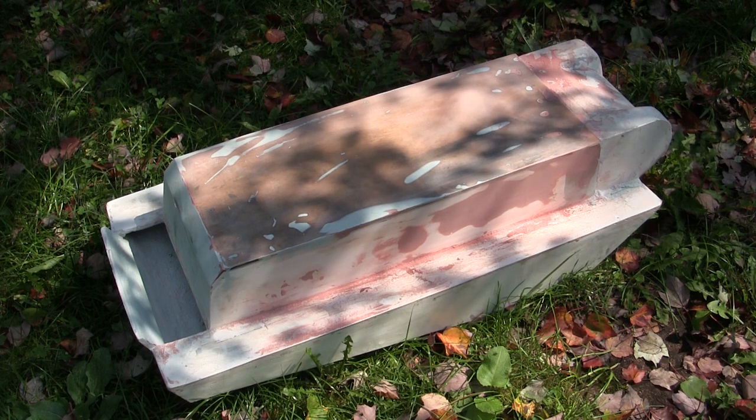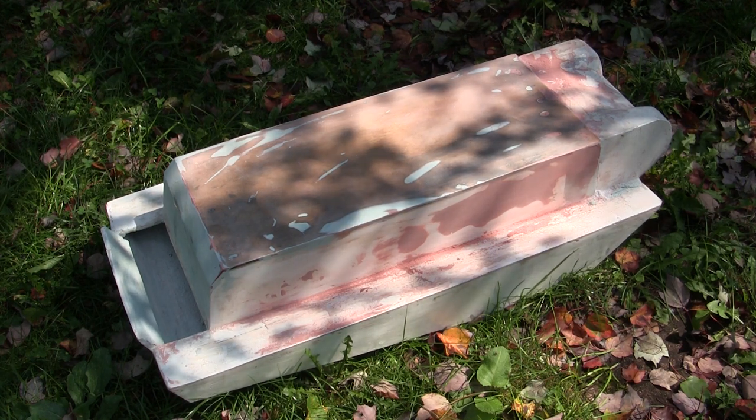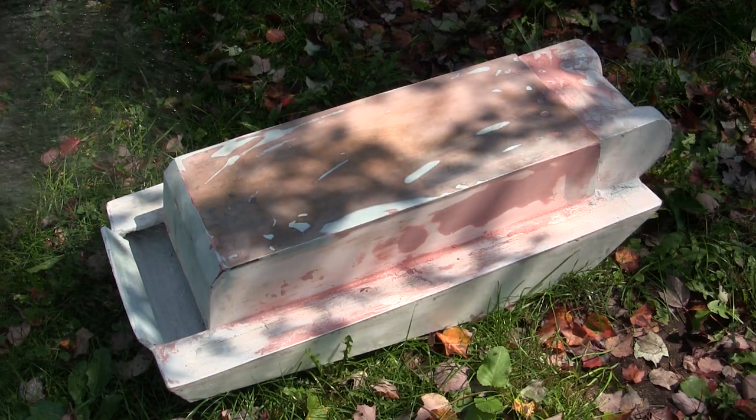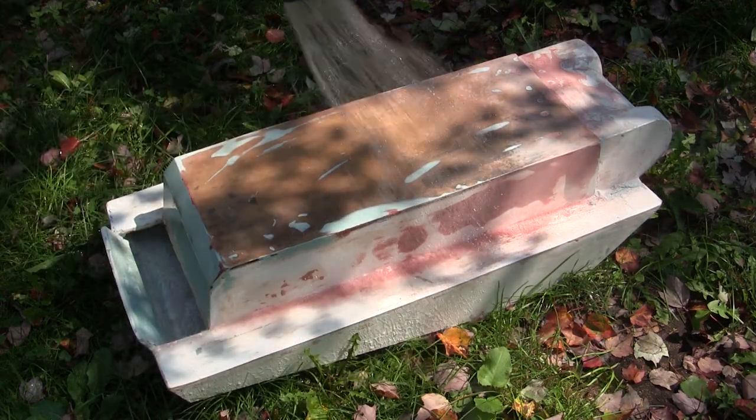So cleaning the model surface does have lots of benefits to it. First, it just makes the model safer to be around. This particulate here can easily become airborne, and if it does, it's definitely not something you want in your lungs. The model is clean, so I don't have to worry about making a bigger mess in the shop. And the other benefit is that the surfaces, if it has a lot of powder on it, may interfere with the next layers of filler and putty that need to be added in order to take it from this point onward. So with that in mind, let me go ahead and start with the rinse.